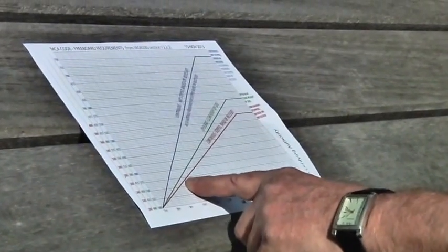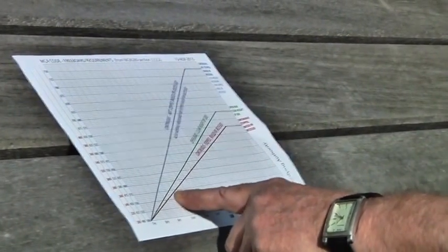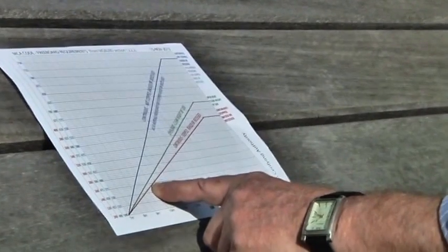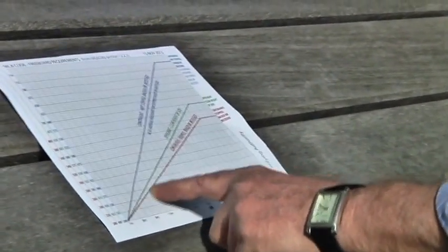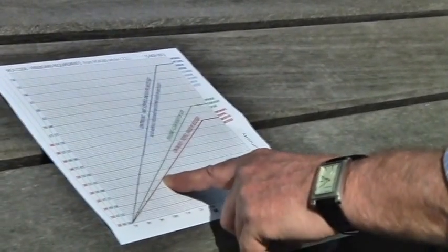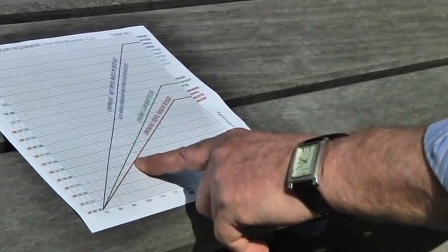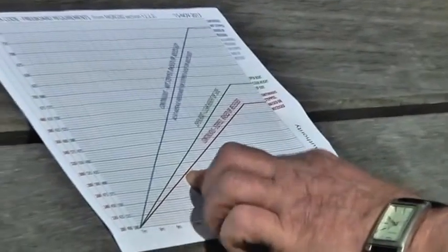So a boat that has a step deck or a recessed deck, the lowest part of that, the working deck above the scupper drains that you're walking about on, typically on a boat like this, the aft deck, can be this height for this red line, but you also have to take average freeboard measurements, and the average of the freeboard to the raised foredeck area and the lower aft deck area has to still comply with what's on the blue line.